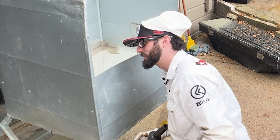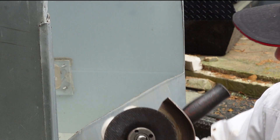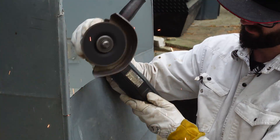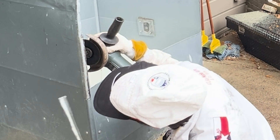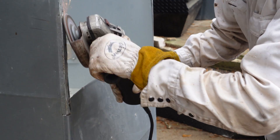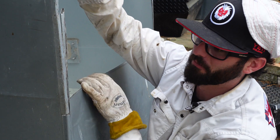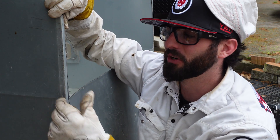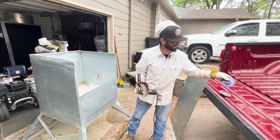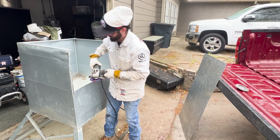We'll start by removing this little bit of material down past where we'll have the sheet metal overlapping - not only this spot but these corners as well - so that we can avoid getting any moisture inside. So I'll cut down just about as much as I think I want, all the way across. Remember, this is one piece and we don't want to get rid of everything. We just want to remove what we don't want. We might have to just cut this little corner right here - it's going to be a tricky cut. And there we have it, we have the piece that we wanted to remove. On second thought, we're just going to go ahead and slap this 3M Cubitron disc back on - I love these wheels, they just cut into anything - and remove this little bit of extra flashing we really don't need.